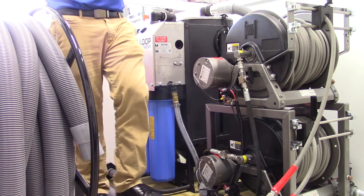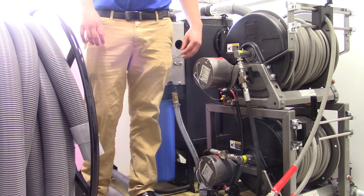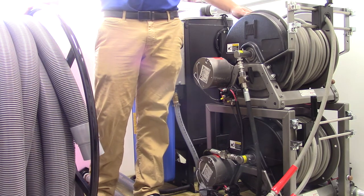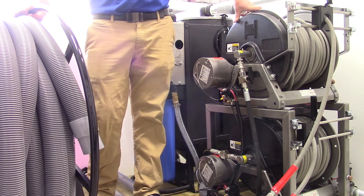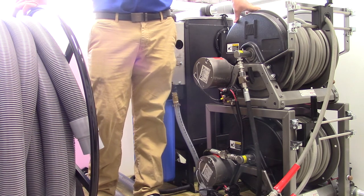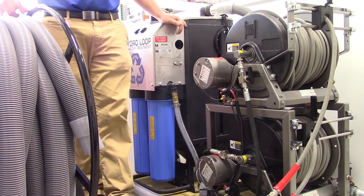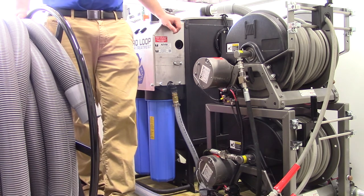You can always call us. We're having issues with the other ones — it just needs to be cleaned out. If you just hear it, let it run through. It seems to be a regular problem — it just keeps happening. Keep draining, draining, draining — that's the number one key. The more you can drain off the heavier solids, the less you're going to plug your 50-micron, and the less likely you're going to plug the suction hose.